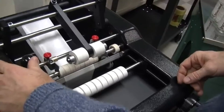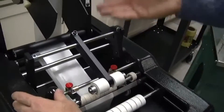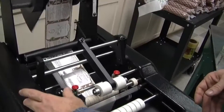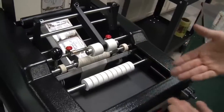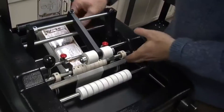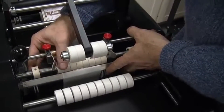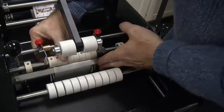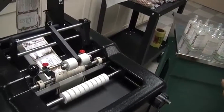You can even it out and try to straighten it as best you can by eye — that allows you to prevent fewer labels from being wasted. Just kind of feed it out, and when you have extra material it allows the labels to straighten themselves out. After you feed a couple of labels, bring these guides in — that locks the labels into place. It's a fairly simple setup, no special tools required.